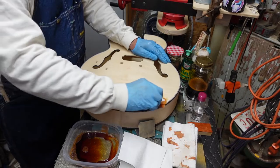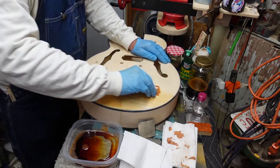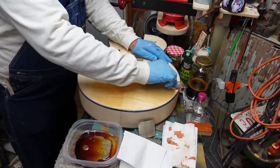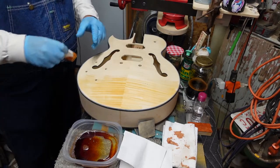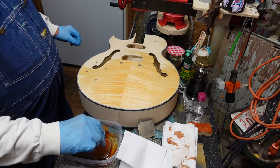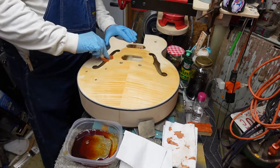Now we're going to put this on lightly the first couple coats because we don't want it hardening up and getting all weird, but look at it bringing out the color of that wood. Give you after here in a second. Now after you get going here, you don't want to let your rag get all soppy and weird when you're starting to do these little areas, because this is where you start making some mistakes.